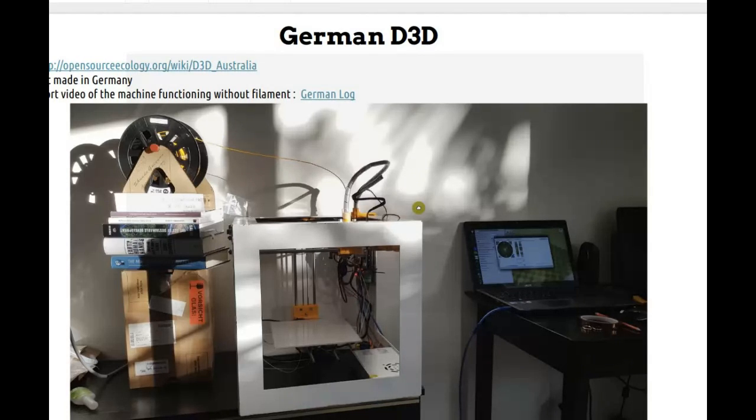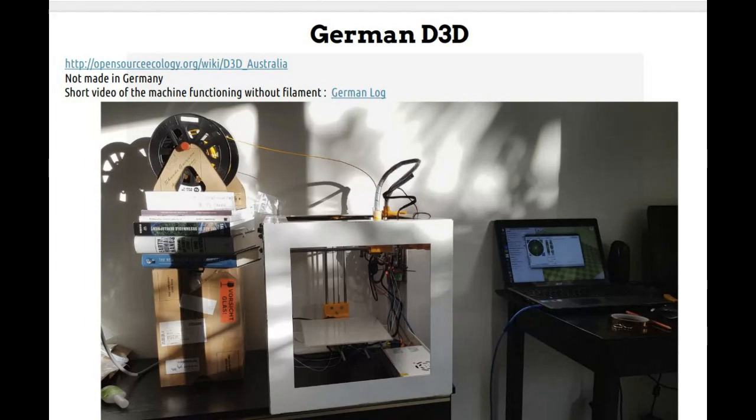I can do that, but I think the only issue that came up with inverting the motor like that, and I only came to the realization yesterday, is that if you have your imaginary Cartesian coordinates on the bed, the x axis on the heated bed is inverted to the other side. So my origin of coordinates is to the front right of the machine, sort of where the power supply unit is. So that was my issue in trying to set up the points for the probing initially. And once I realized that was the issue, I managed to get the points where I wanted them.